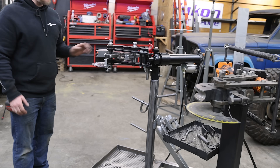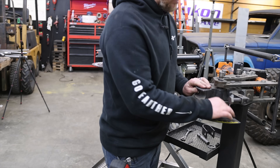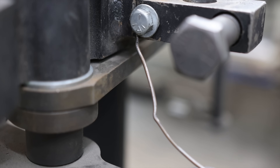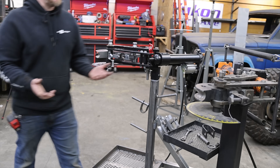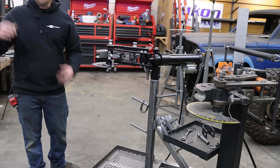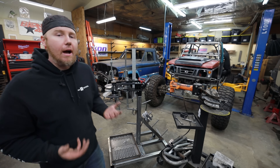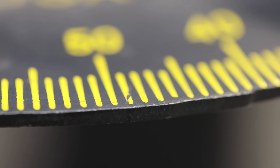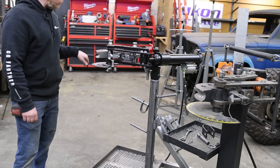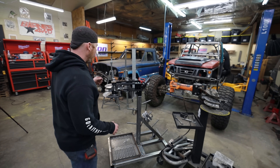One last thing that stuck out to me right away: the pointer on the degree dial is so nice and precise, whereas the JD Square dial pointer is basically a piece of welding wire that you just bend and contort. This is a really beautiful, well-machined piece. On top of that, the degree wheel itself — the JD Square is just paint on a piece of steel, but the Swag's markings are etched down into the metal and filled with paint. When you want something to last 30 or 40 years, etched markings are going to remain clearly visible far longer than painted ones.